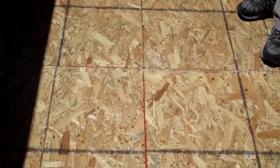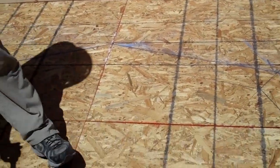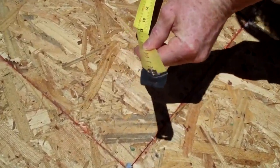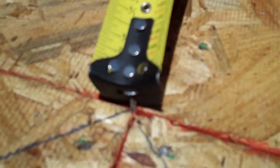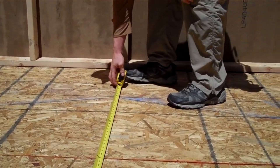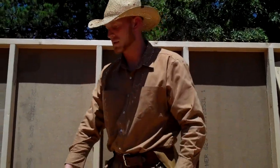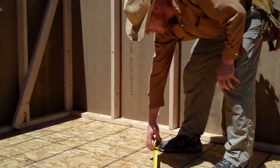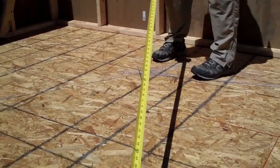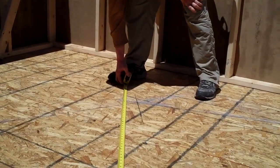The way you do that is you lay it out the same way on the floor of your barn. If you use dimensions like I did — six feet, which is half of a 12-foot span — you can lay it out on the barn floor. Choose a straight square line that comes out six feet, put a nail here, hook your tape measure onto it, measure out six feet, and put another nail. You want to be real exact because the more exact you are, the better your layout will go. Then do an arc — in my case it's about three feet two inches out.